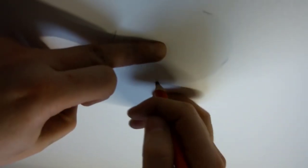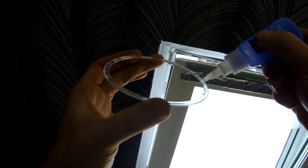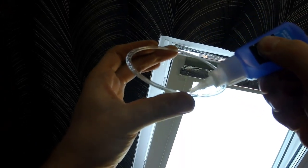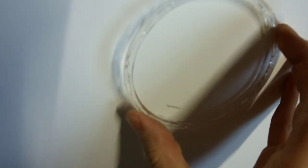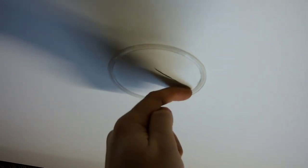Now install the lights. We press the ceiling a bit and find the areas for the lamp. Circle them with a pencil, glue the ring of the desired diameter onto the ceiling. Put glue on the ring and press the ring to the stretch ceiling. We check the ring is stuck and cut a hole for the lamp with a knife.